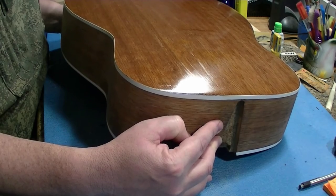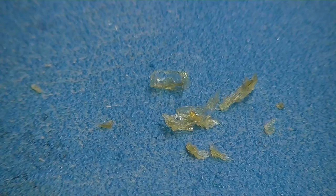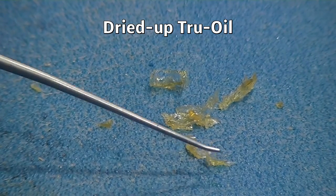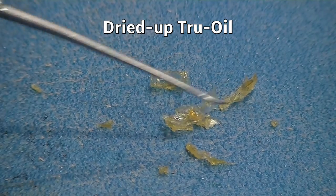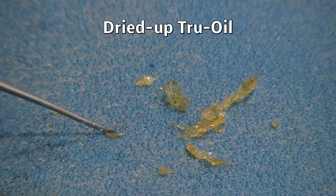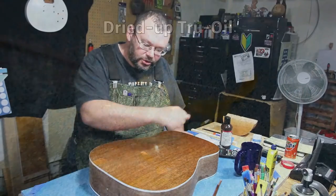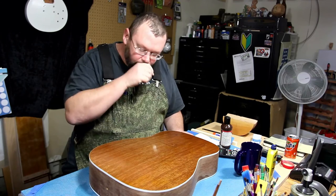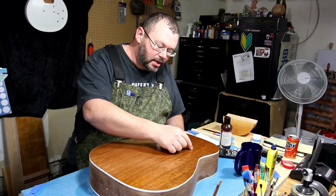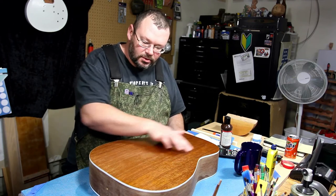What that is are these little teeny tiny crystals that come down off of the True Oil. And it doesn't take much of one. But when I'm doing my finish, my last finish wiping down, that little crystal drags across and it makes those little areas.